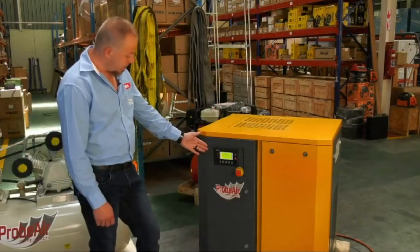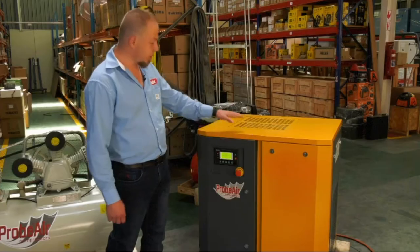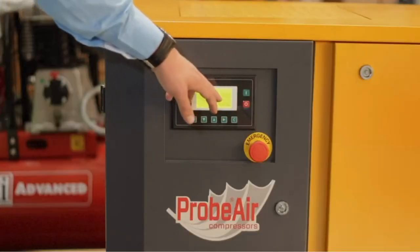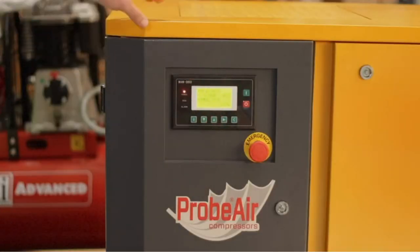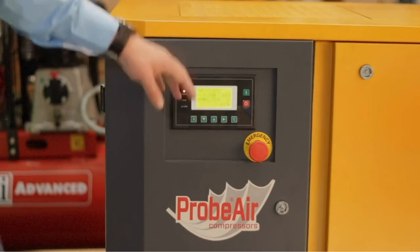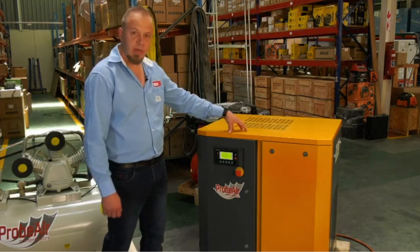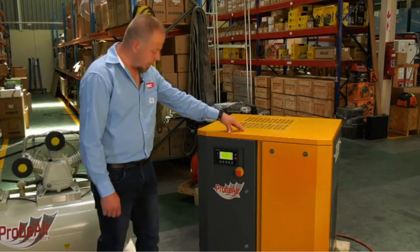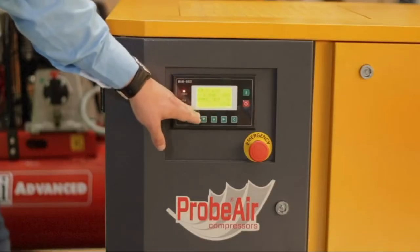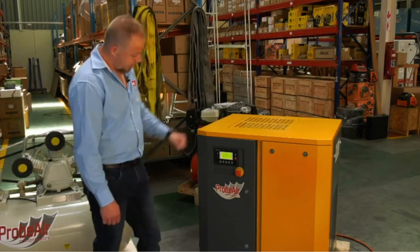You can see we've got the MAM 860 here. This controls the whole machine — the safeties, the running hours, the loading hours. You've got the start-stop there and emergency here. You can set all the parameters on the controller itself, and this basically monitors the machine safeties and operations of the machine. If something should happen, the safeties will automatically send the signal through to the controller and the machine will shut off immediately.